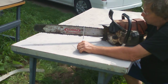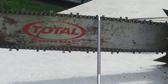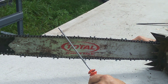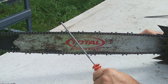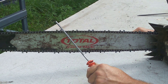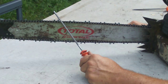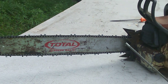If you take your rakers too far it'll be so jumpy and you won't have enough power to pull it in the first place. Here's another advantage to full skip — it's a third less cutting teeth. That's a third less chance to screw up, and a third less time for me to sharpen when I've got a skidder running right up my back. There are several advantages. Full skip came out when loggers started running 60 or 70cc saws instead of these 90cc saws — it was brought out so you could cut with less power and carry less weight.